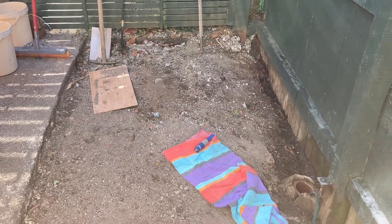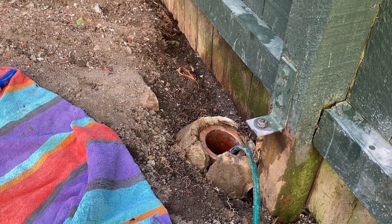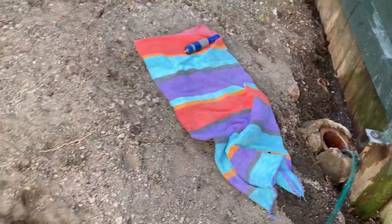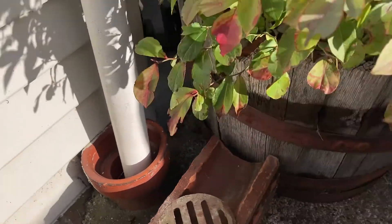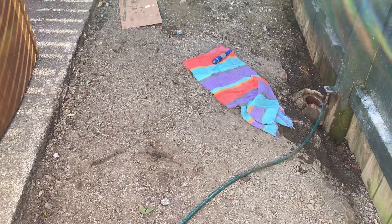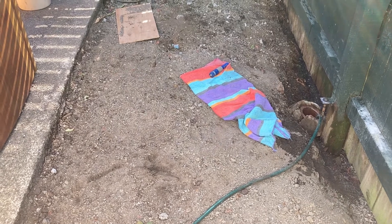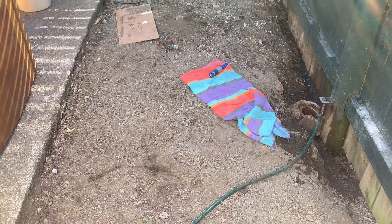Building this little retaining wall. One little bonus of the whole thing is I slowly tapped away at this area here and found a working drain - I've managed to clear all the dirt out of it. It goes across this area which means I need to be especially careful to put some good reinforcing mesh and make sure the concrete is at least six inches thick, so that we keep that drain working and it doesn't get damaged by any weight on top of it.